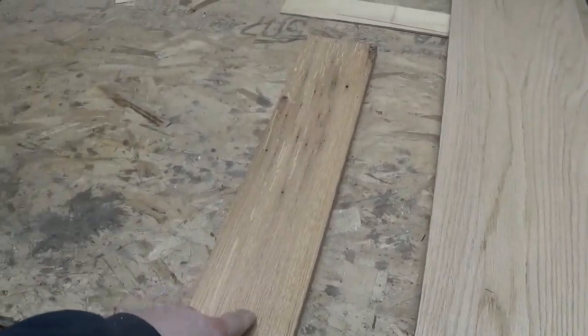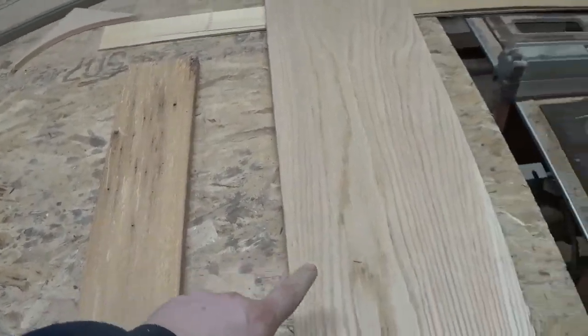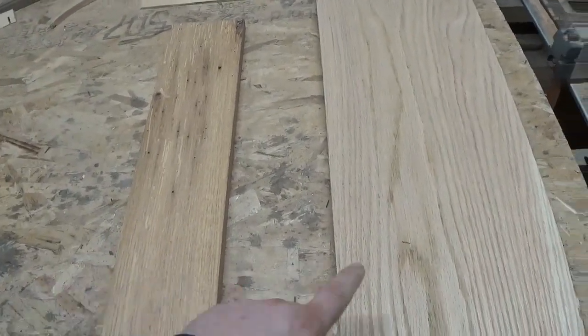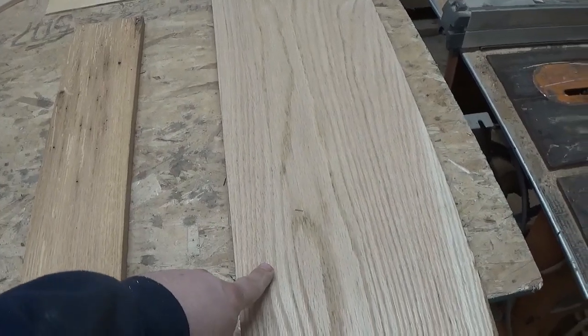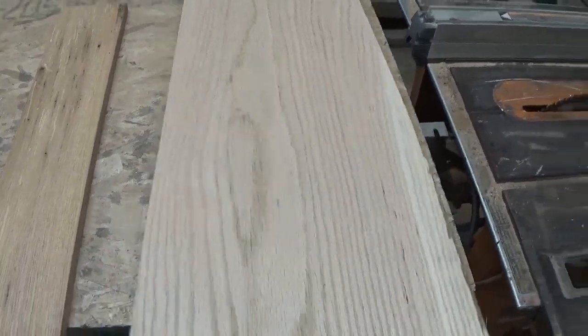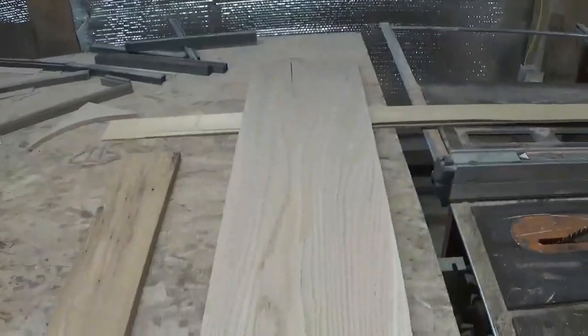So I'm going to make a piece of furniture out of this quarter sawn one, and something maybe not as important out of the flat sawn one, since that one is going to bow. I would not make a table top out of flat sawn wood — you can, but you might have a customer come in and complain. That's the difference. If you like what you saw today, hit that little red button at the bottom to subscribe so you don't miss any upcoming videos. This one is your quarter sawn — better than the flat sawn. Hopefully now you understand the difference between flat sawn and quarter sawn. Alright, thanks, have a great day.